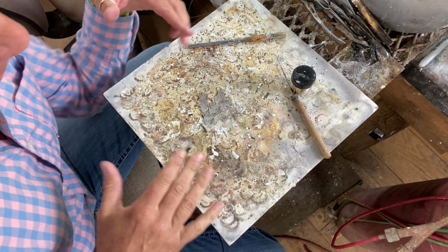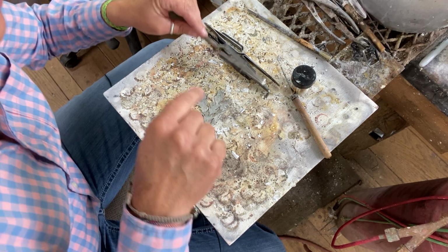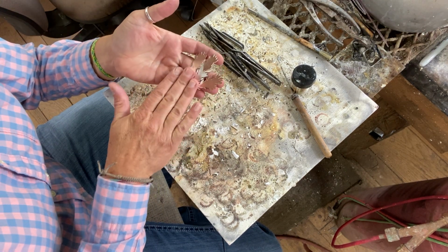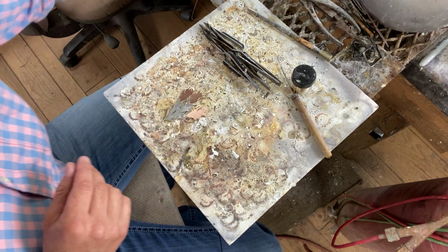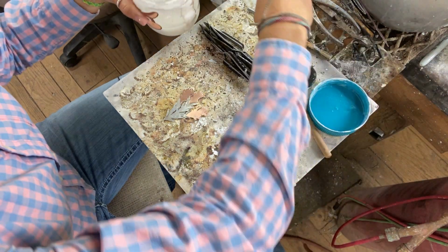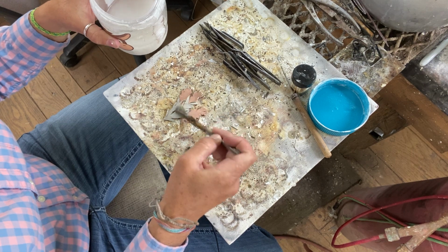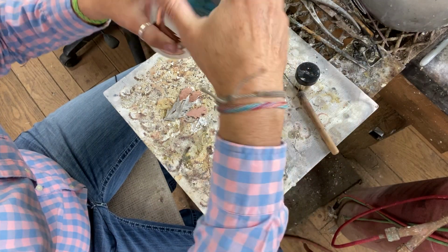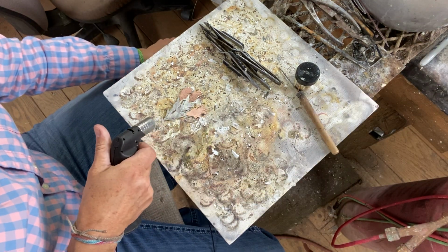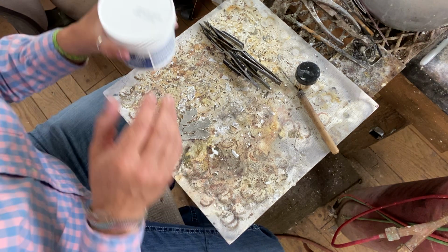Okay, so this is how I'm gonna set this up. I have my 4 pins that I'm gonna use, and then we do not want to do anything with the front. What we're going to do is take my slurry, get that boric acid, denatured alcohol all mixed up. Then you can just stick your paintbrush in there, paint the top of this, get rid of this. You do not want to light this fire with that tub very close to you. It is very dangerous. So then what I'm gonna do is I'm gonna take my handy flux.